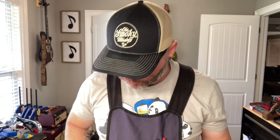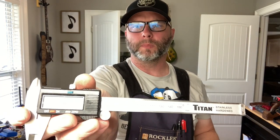And the way that you check your thickness, get yourself a little caliper. I mean, you can buy one from Harbor Freight, man. I think this guy was under $10 with a coupon. And they're accurate enough, you're just getting an estimate of what the thickness of that piece of wood is, right? So it doesn't have to be super accurate, but I like this caliper for a lot of my guitar work. This is a luthier's caliper, and you'll notice that little notch right there. That's really handy for measuring fret height. I don't have to estimate with feeler gauges anymore. I know what it is with this, just that quick.